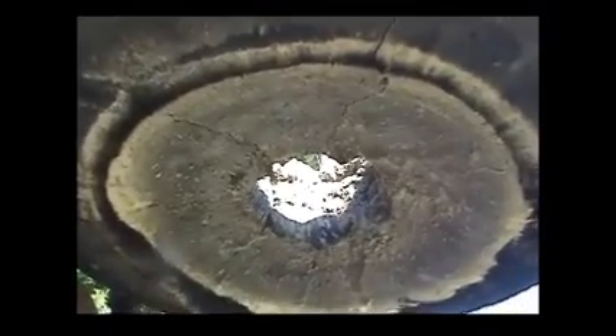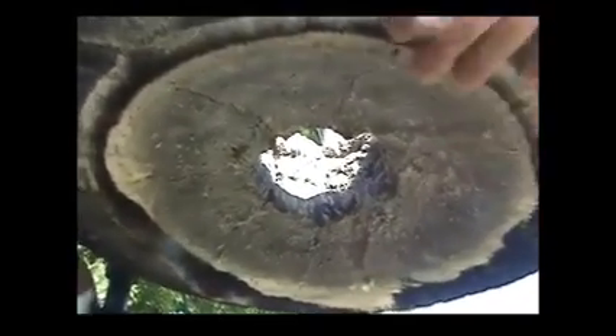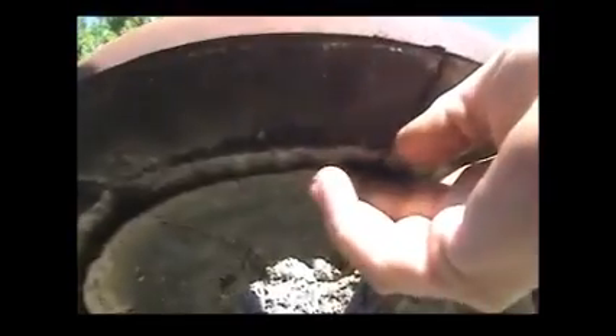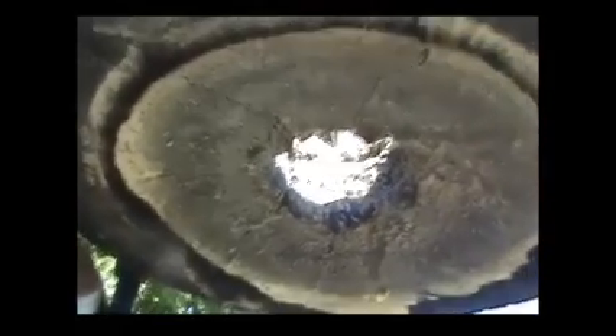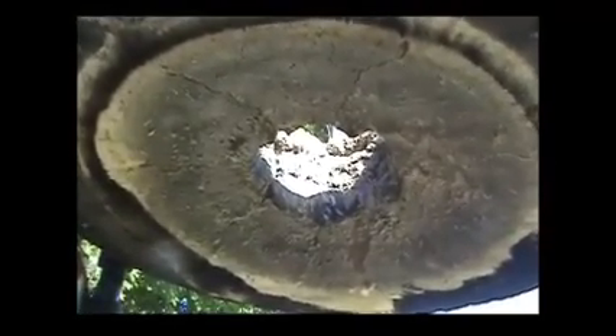This is a shot of the underside of the lid of my furnace. You can see it's flat right to there and then it dips in. It was made that way because I didn't have enough refractory to fill it up. It's got some welding rods welded in that lid that keeps the refractory in there. Cracks have been there since day one. You can see where slag and iron and everything is running down.